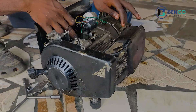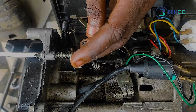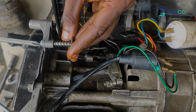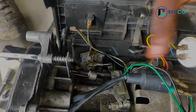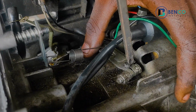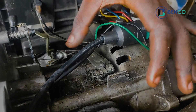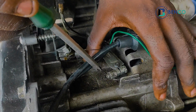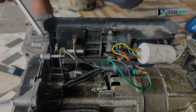Okay, this is the governor itself. This is the spring I was trying to adjust. Everyone adjusted it to the very end at one point, but it still didn't work out. If I had adjusted this and it loosened off, the generator would have gone off — and that still would not fix the generator. So it is crystal clear that the governor is at fault. This particular rod here is connected to the governor inside the crankcase, inside the engine. But of course, there is every possibility we can adjust the governor from just this rod here. Without wasting much of your time, let's dive straight into business.